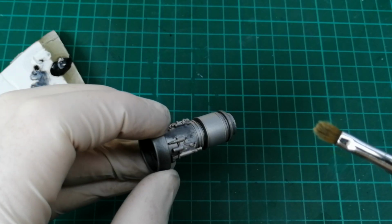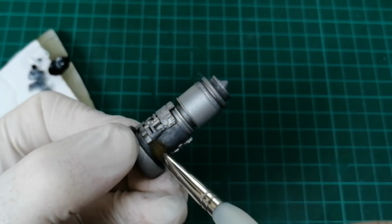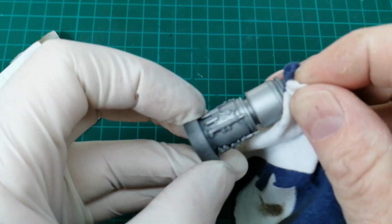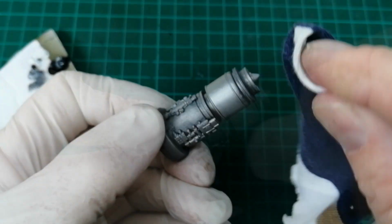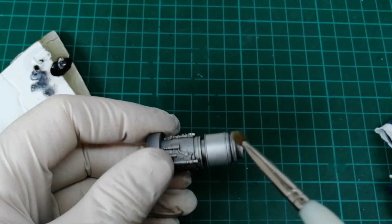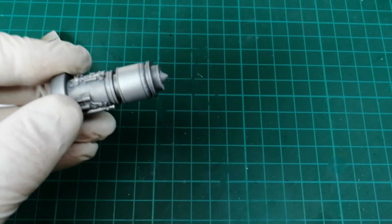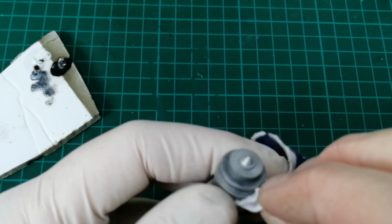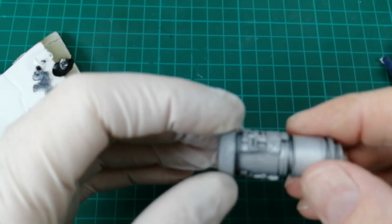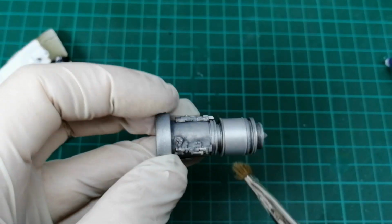And then with a brush soaked with a bit of odourless enamel thinner, just blend it in. And a cloth, just take the excess off. Now you just want the littlest of thinner on here. I'm just reactivating, sorry about that, I'm just reactivating the dried oil and then just dab in patches here and there just to make it a bit blotchy. And so it's just about messing around really. Just a bit of a tarnished look.